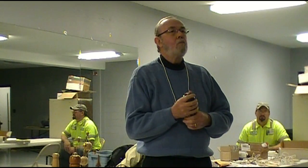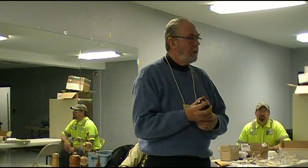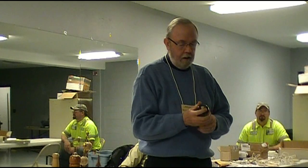And Bruce, if I use what Mel suggested, start with your Forstner, and then maybe you're half an inch in, and now you've got the exact center, and now drill that exact center with a pilot for the rest. What size pilot would you use? Just something undersized, something small. Maybe a quarter inch, just a bit smaller than the point on the Forstner. Okay, I'll try that.